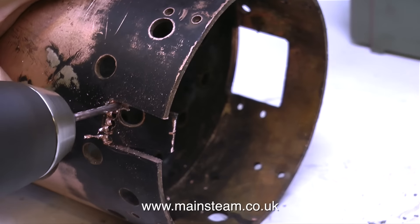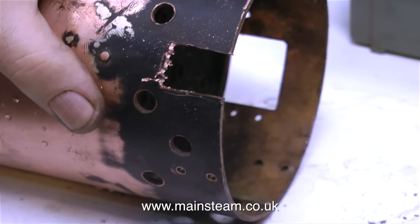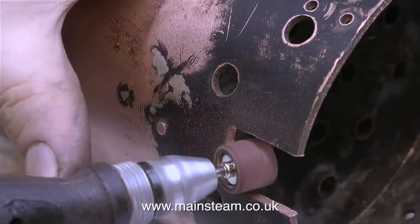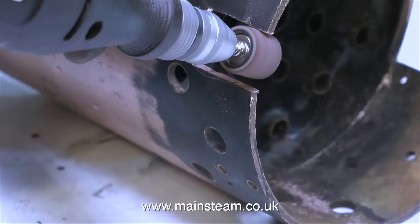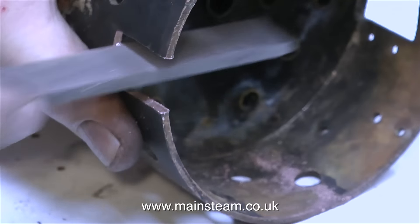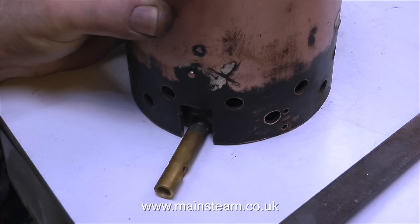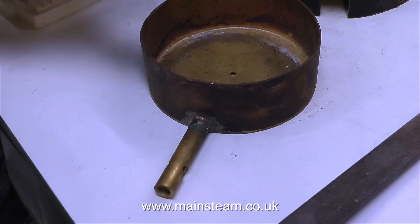And now for something completely different. This boiler is going to be gas fired, and in order to do that I need to fit a gas burner. The gas burner has a long tube where the jet sits, and this tube has to come outside the boiler — if it was inside the boiler, it wouldn't breathe properly at all. What I'm doing at the moment with a combination of my small file, a larger file, and my little drum sander is cleaning up the hole. If a job's worth doing, it's worth doing well, and eventually I get a nice neat square hole. This is similar to the type of burner I'll be using, but this one's miles too big — it's a burner I started making for a boiler I was going to gas fire but changed my mind and made it coal fired, and I never finished it.